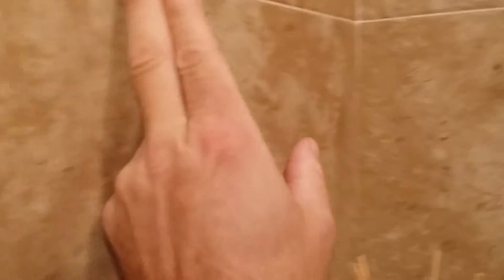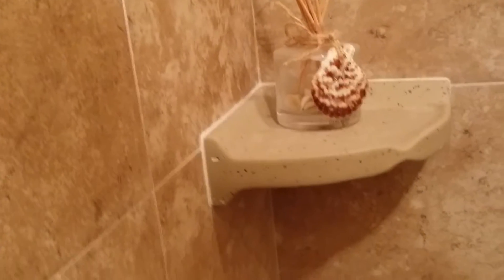This is a standard shower door we purchased at a local box store. And as you can see here, this is what we do as opposed to other companies. We basically grout and clear silicone the corners. Most people just put grout in there, and if you don't clear silicone, it will crack out. As you can see here, this is about a year and a half, two years old — not even a little crack.